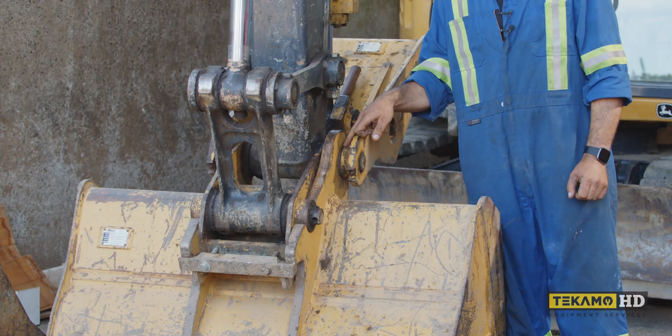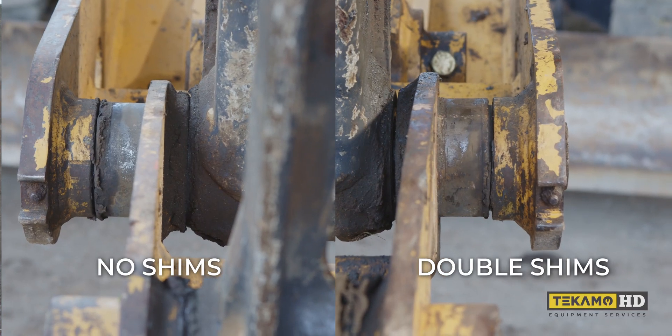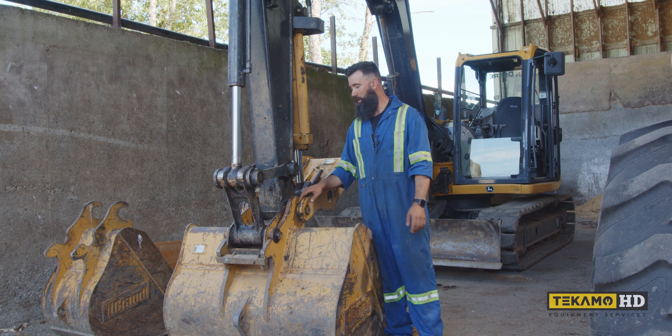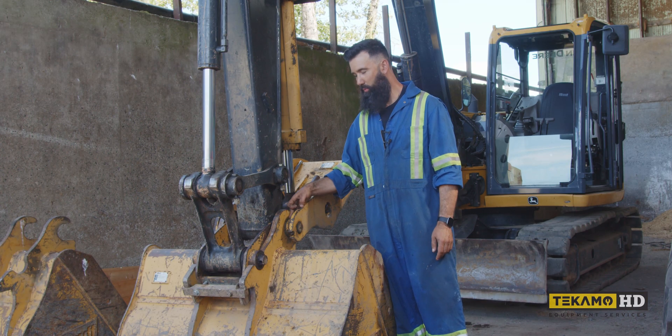You can see here this has been shimmed before but it was done incorrectly. The shimming should always be divided equally from one side to the other — it's just good practice. It kind of shows that you care about the work that you do. This looks like it was done last minute because both shims are put in on one side.